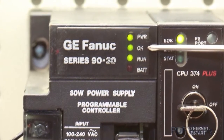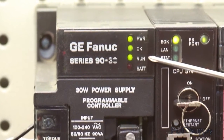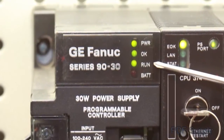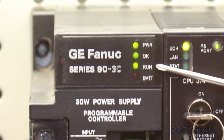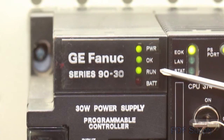There is most likely a hardware fault. The green run LED indicates that the CPU is in run mode and is solving program logic properly. Your problem most likely lies with the field devices and not the PLC system. If this LED is off, we will walk you through troubleshooting later in this video.